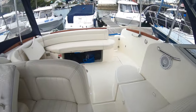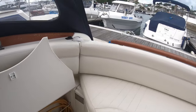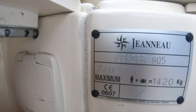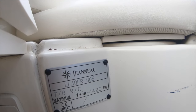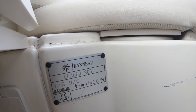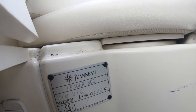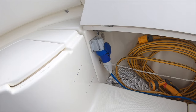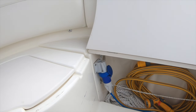The mechanical area is under the cockpit floor. The boat carries an RCD Category B plate — meaning it's fully compliant for proper channel crossings as a genuine offshore boat. Specifically it's rated 7B — Category B for seven people — and 9C for nine people inshore and coastal. Shore power plugs in down here providing the 240-volt system.